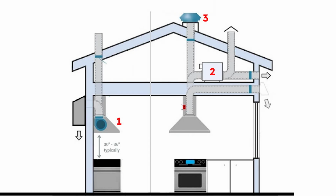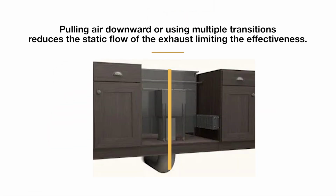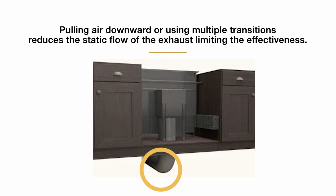The ideal ducting follows gravity, guiding the smoke where it naturally wants to go, straight up. Short horizontal runs straight back are also acceptable. However, downdrafts direct smoke downward against gravity and require an elbow joint to transition, which reduces efficiency. Most downdrafts also need longer ducting runs, reducing the airflow. It's not a new issue, really.